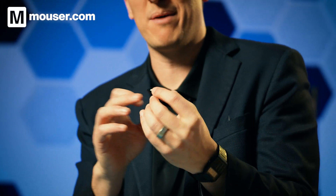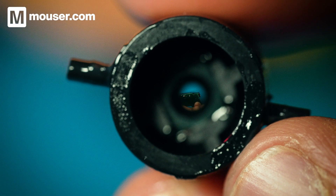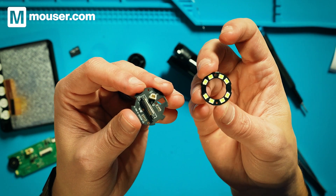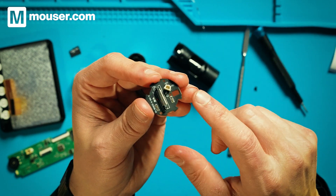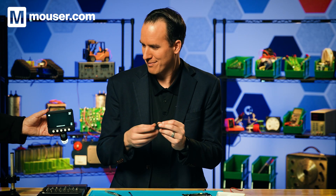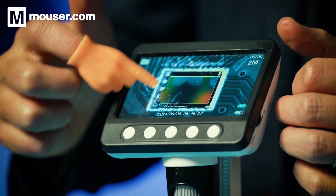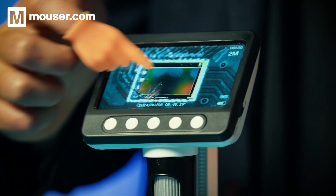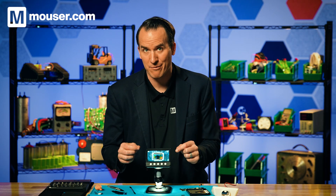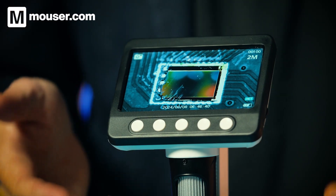There's a little lens in here — probably not glass, probably plastic — that's going to focus all the light coming in right on that little optical camera chip. So this is our LED board. It's just eight LEDs. There's no drive circuitry on here; everything is on our camera sensor board. And I wish we had a microscope to get a better look at this microscope. Here's our chip up close. You can really see where I massacred that sensor trying to get the glass off. Unfortunately, the geometries on this camera sensor are too small to see — even with this microscope, you probably need a much higher grade one for these types of sensors.